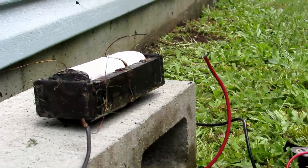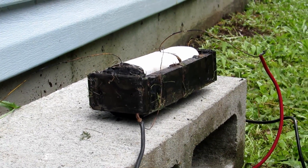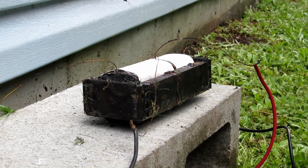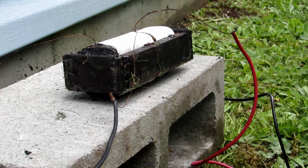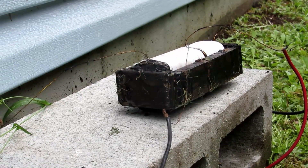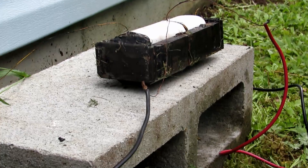I hope you guys enjoyed this video, and look for future videos on how we can create 50,000 volt transformers with this. The reason I'd like to use this over a microwave oven transformer for 50,000 volts is it's much larger, so you can put way more windings on it. With a microwave oven transformer, to create 50,000 volts you'd have very few primary windings, which would melt out your transformer. With this, we have the option to put in several, several windings because of how large the transformer is. In a future video I will definitely be doing that - hope you guys enjoyed, see you next time.